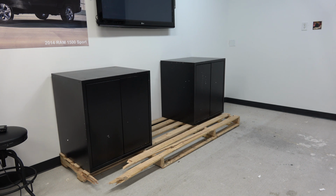Don't measure from the ceiling down. You can measure laterally from one unit to another to get everything spaced out right. You can look at a bubble level and see if you are spot on for how you need to be against the horizon, and that's it. That's how you get things level. Never measure from objects that could be uneven, because you will get it perfectly with the floor, but you're going to find out the floor is uneven, and when you look at it with your eyes, you're going to hate yourself.